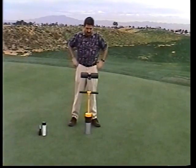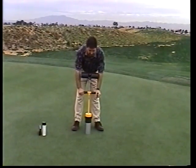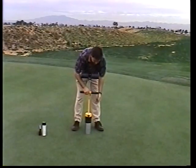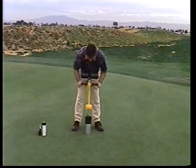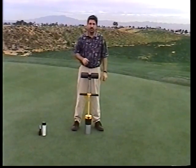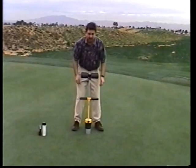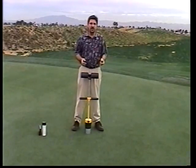Now that we've got it all together, let's cut a cup. First thing I'm going to do is turn my hooks opposite my pins — you can see the hooks on the blade and the pins on the hammer. Now I can start to cut the cup. First I want to get it planted in the ground, check my level, make sure I'm straight, then just continue. You'll notice I'm really not exerting much force — I'm just flicking the hammer down onto the top of the blade.